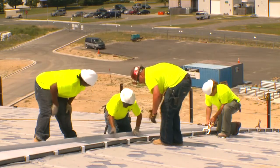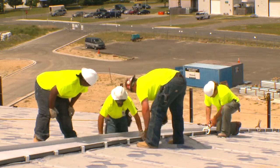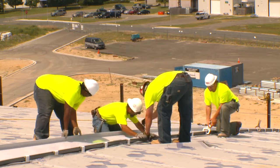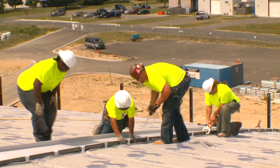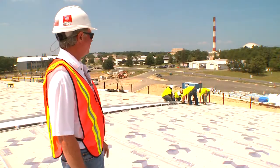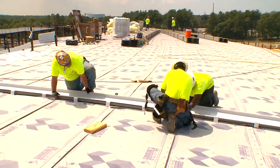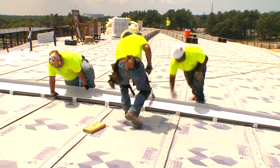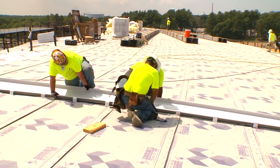What we're doing now is interlocking the first panel into the gable end of clips. It happens to be located at a building expansion joint. These clips are spaced 24 inches on center, as prescribed. This is the first panel of a series of panels, which will be installed in sequence following the first panel.